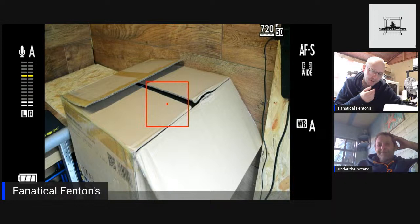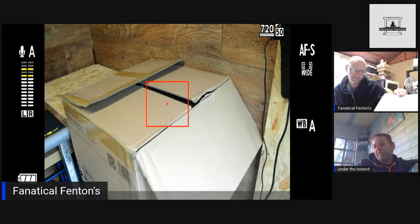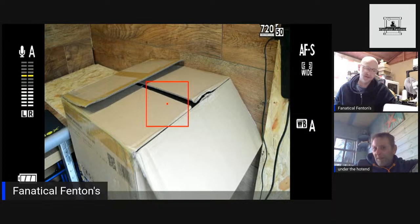The guide I got from Mandy at Creality — just reading it was like, right, it all works, spot on. The normal running speed is 250 millimeters a second, which could be fun. Someone in the group posted yesterday that they cut the time for their lithophanes in half — the outer was doing 200 mm/s and the inner was 100 mm/s. I thought I was doing well with the Hornet at 80 mm/s.